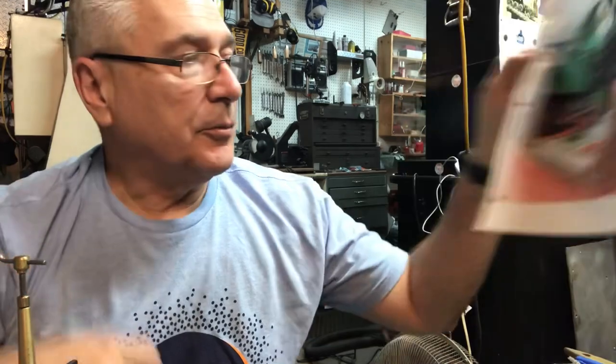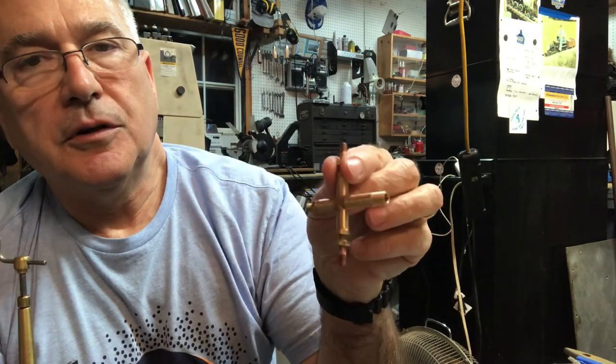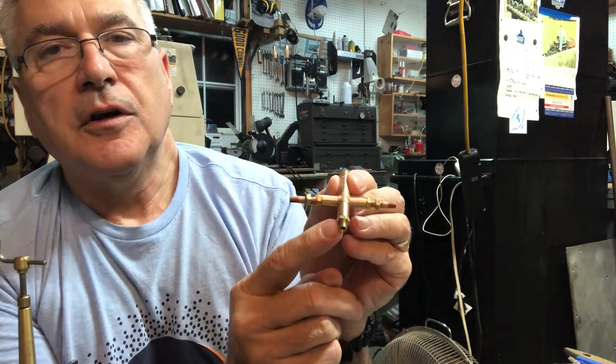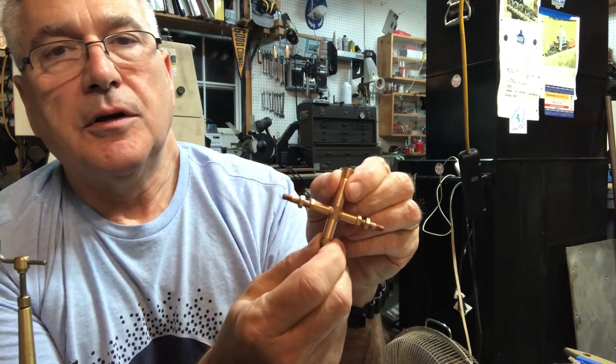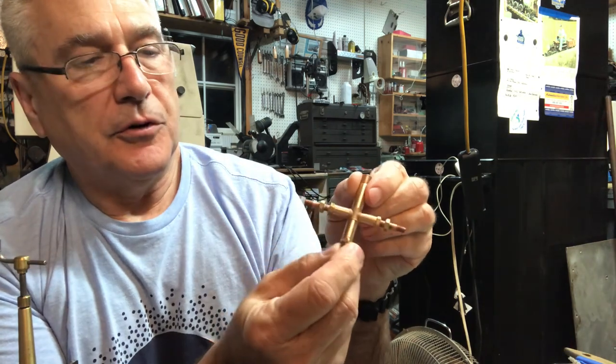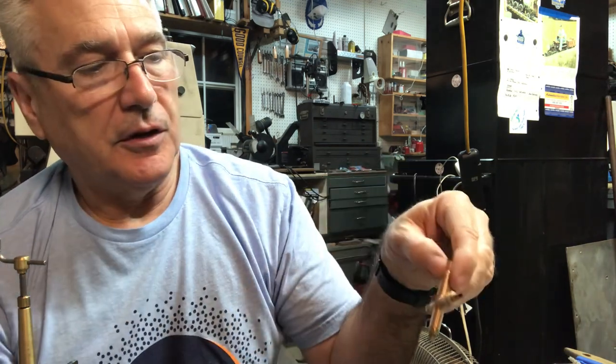In this week's episode, it's relatively brief compared to others. We'll cover making the steam inlet tube, a little cross piece, which also involves an oil fitting down here at the bottom. It's spring loaded with a ball bearing, a little pressure fitting, so we'll talk about making that.